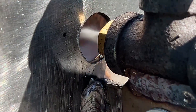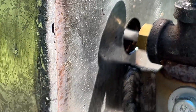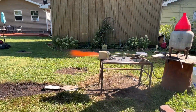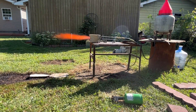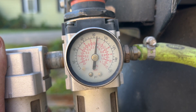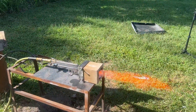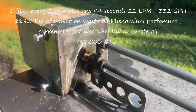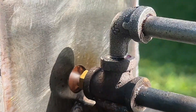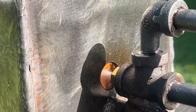What we're observing here is the ignition flame, or flame holder — this area of the combustion chamber is key to its functionality. We are causing a turbulent fireball to rotate towards the back of the burner, which constantly sustains a pilot light region that keeps the burner lit. Without that tiny hole in the back flame wall it would not burn at all. We're at about 85 PSI at 18 cubic feet per minute — that's a lot of power. We're going to do a power output test; I believe we burned one liter in two minutes and 44 seconds.